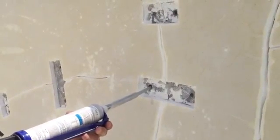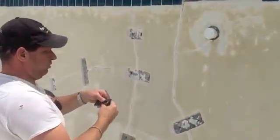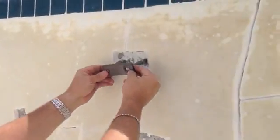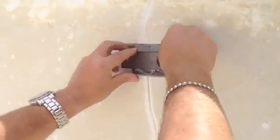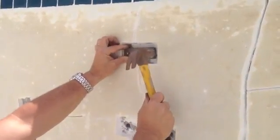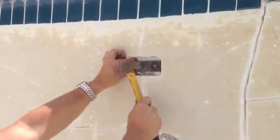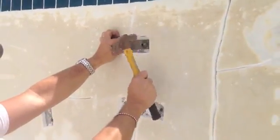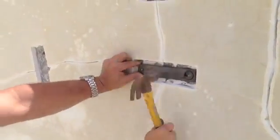If you're doing it like 10 at a time, you want to do them basically all together. We have extra tips, so it's not a big deal. Always set your staple with the square on the inside — that's where it's at its least resistance. Sometimes you're going to have to take a hammer to tap it in, sometimes not. When you tap it, you want to tap it in evenly. And there you go, that's all the way in. Let that set up before you torque it.